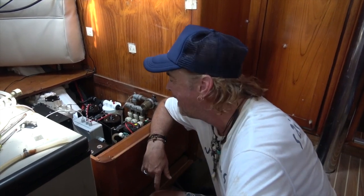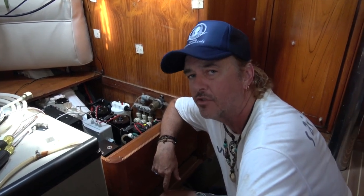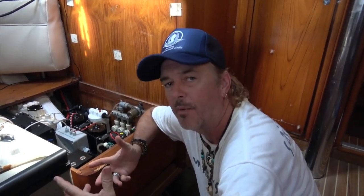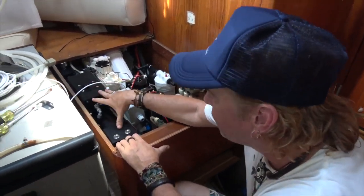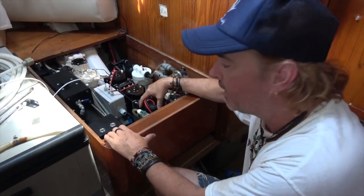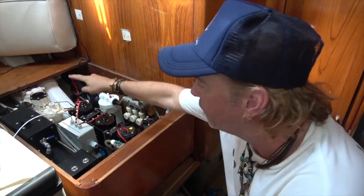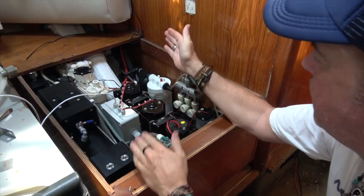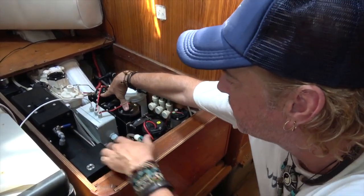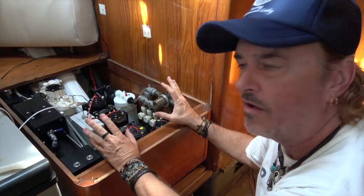After much deliberation — and I mean much deliberation, playing a bit of Tetris with all this — I think we've got it figured out. Everything is actually going to fit in here and still be accessible and serviceable. That's the important thing: it's one thing to get it all in there, but another to be able to take it apart when you need to change filters or a pump. The desalinator fits right here where I wanted it. Our water pump is still in place — you can hear it running right now. We've also mounted the booster pump for the reverse osmosis system, which squeezes in perfectly. The pump system for the desalinator fits right in the middle on its rectangular platform, like a glove — right in the center, just like Central Park.